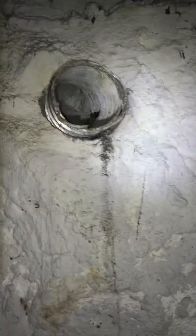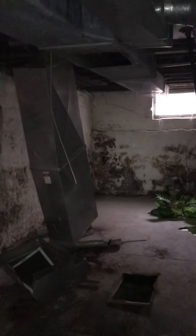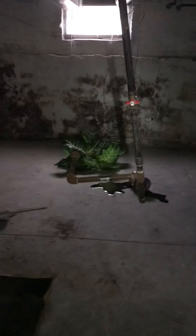This one was set up for 80% with a liner, and it looks like it's in bad shape, so we'll come back with a new liner. I'm going to pop outside and see how tricky that is. If it's tricky, we'll come back with an 80% — same deal: new return drop, new base, furnace, A-coil, plenum, gases. We just need to reconnect.